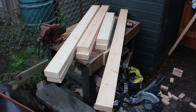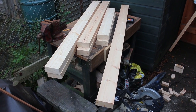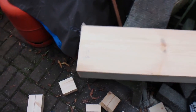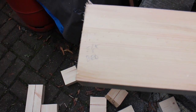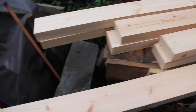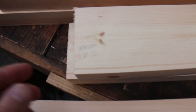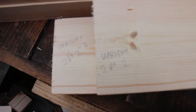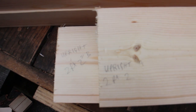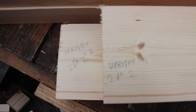I've done quite a bit of cutting here, so I'll just run through all the dimensions for you — get a pencil and jot them down. It's all four by two softwood. The lathe bed itself is five foot long. The legs have three sections because they're cantilevered legs. The short section — you need two of these — is two foot two inches.